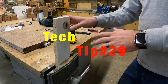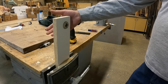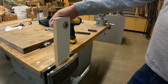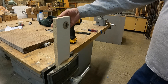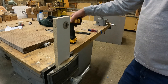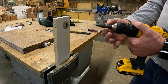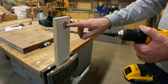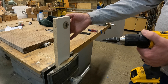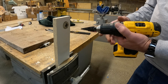There are all these different ways to get old through-hulls out. One of them is when everything is inaccessible on the back side and it's glued in, and shop rates are super high — a couple bucks a minute. One thing we can do is, if you have a big enough step bit, from the outside where it's easy to get to, you can knock off the head of most of these through-hull penetrations to replace them. It's all about being fast.